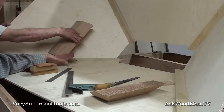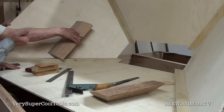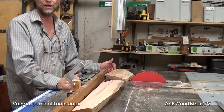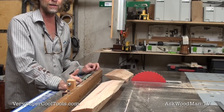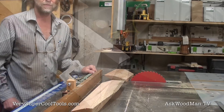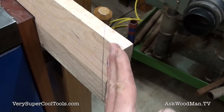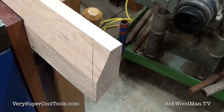What we need to do is pass a plane through these three different angles here. I'm going to do that with the Japanese saw. I'm almost happier just cutting this freehand to my mark and then trimming it with the belt sander, leaving my perfect 90-degree setup right here. I don't think it's worth it for just these few cuts to set that up, so I'm going to do it old school. I'll stay on the waste side of the line and pass a plane right down through these three different surfaces, then touch it up with the big belt sander.